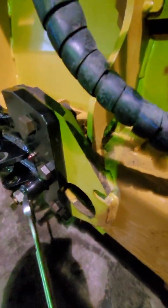And then last but not least are these guys here. That's going to be your 1 1/8 wrench. And I've actually added these locking nuts here, which is very easy. You just back off your bolt and then thread on a nut. And that makes sure that this bolt doesn't back out and it stays at your adjustment. So I'll go ahead and slack this just to show you guys how much tension is on these.